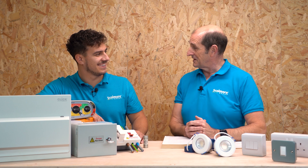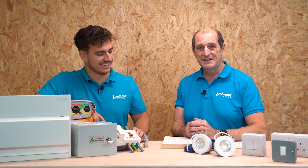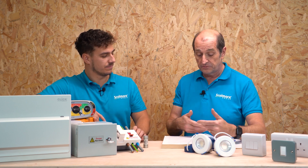Where does this three metres come from? Is it an old wives' tale? It's not an old wives' tale, but it is an old regulation. It comes from the international standard — it's an internationally coded value that has been there for a very long time. So can you install a consumer unit more than three metres away from the main cutout? Absolutely — as long as you're following these regulations we've mentioned and providing it with that level of protection.